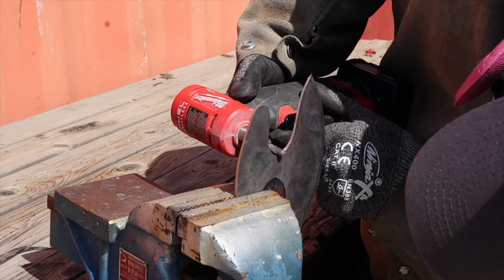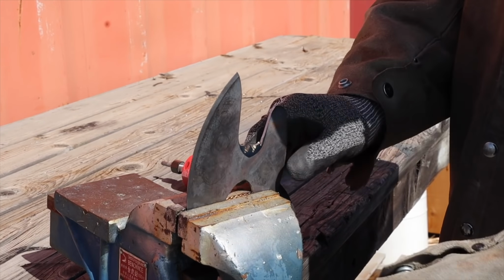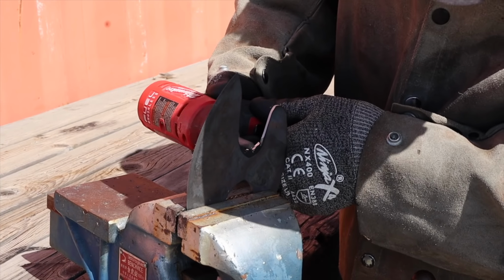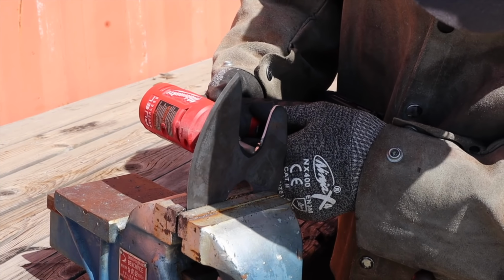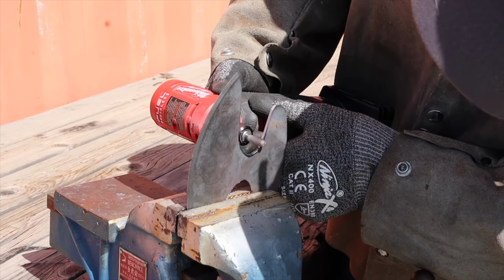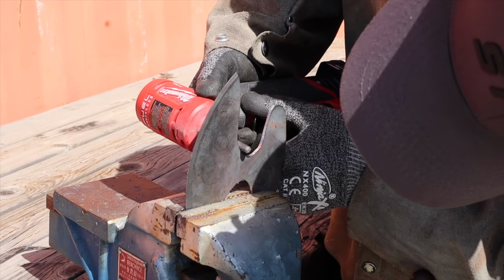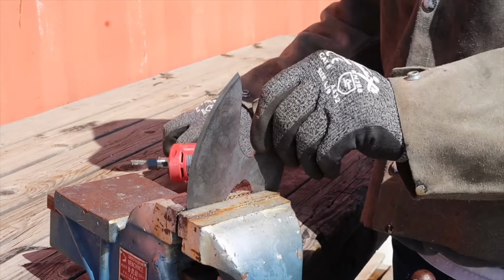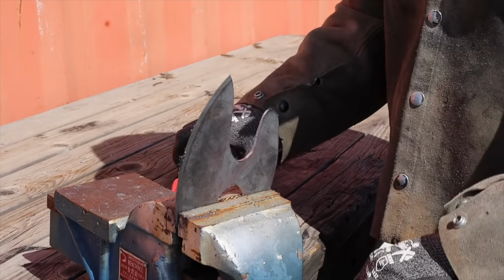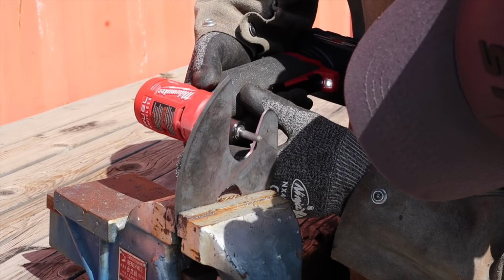I used to use an oscillating spindle sander, and while the variety and types of abrasives available weren't that amazing, it was actually really nice for applications like this, because it allowed you to get right in there. That's actually a single cylinder spinning around, rather than the arc that the belt runs at, and that's what was too wide to get in here. I would have ended up taking the tip of the blade off, and I really wanted to preserve the length of this blade. So that's why we did all this cleanup here using this little tool. It worked well.